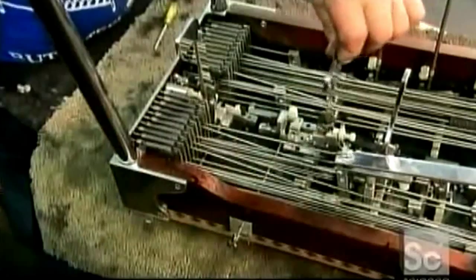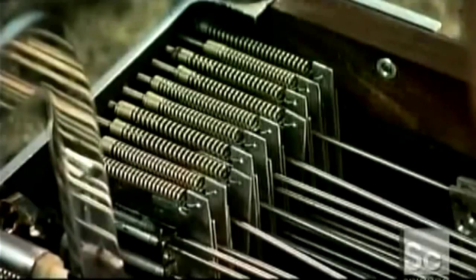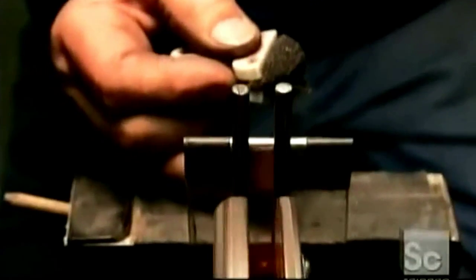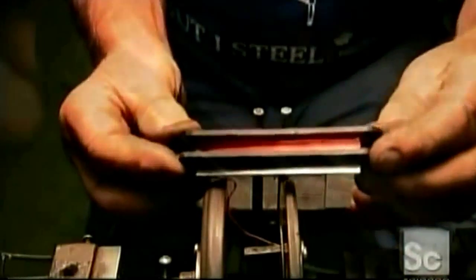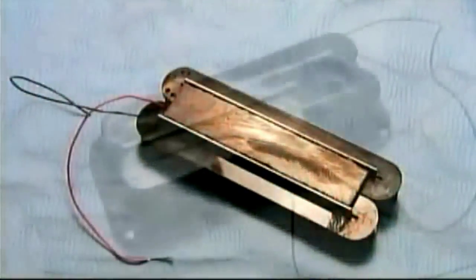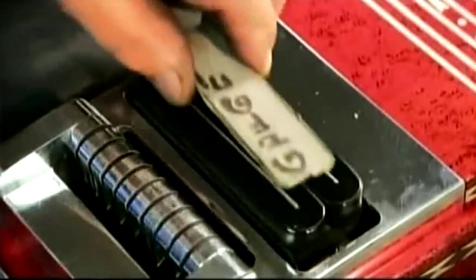The guitar maker tests the knee lever. Here, he's winding copper-coated wire around a cartridge thousands of times to make the guitar's pickup, which transfers sound from the guitar to the amplifier. He takes two of the wire-bound cartridges and places a magnet between them to complete the pickup. Then, he fits it into the other slot in the pickup plate, just above the fingers.